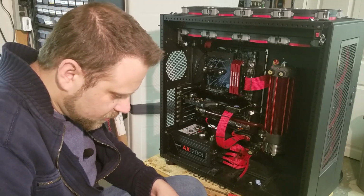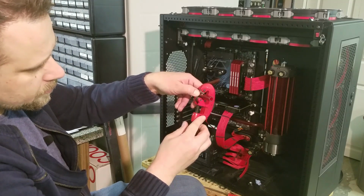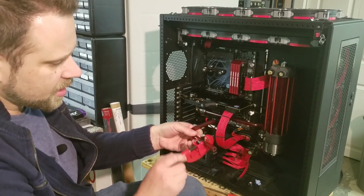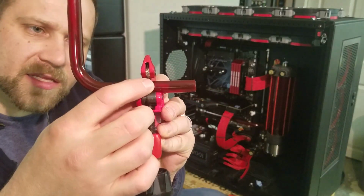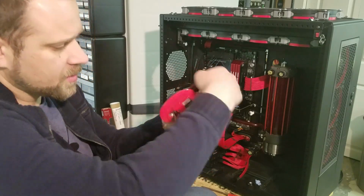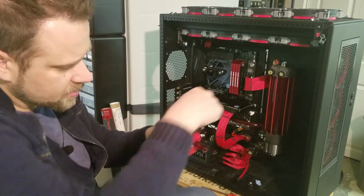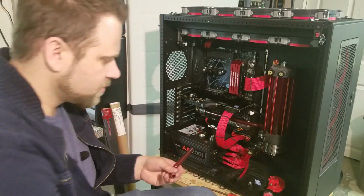Now you put the tubing into the pipe cutter, and you rotate the bottom wheel until it snugs itself up against the blade. Now the blade is actually a wheel itself, so once it's sitting nice and firm, you can go ahead and just rotate the tool around the pipe, and it cuts or scores the tube, as seen here in the video. Now you can turn the wheel a quarter turn and rotate around the pipe, a quarter turn and rotate around the pipe, and continue to do this until you cut all the way through the tube. Now we'll just remove the excess and see how it fits.